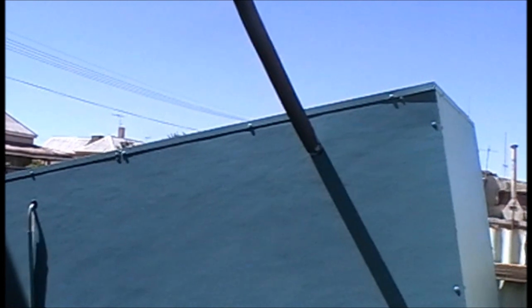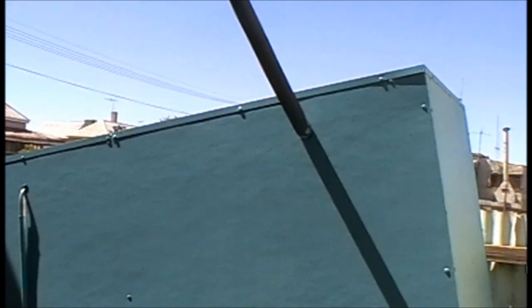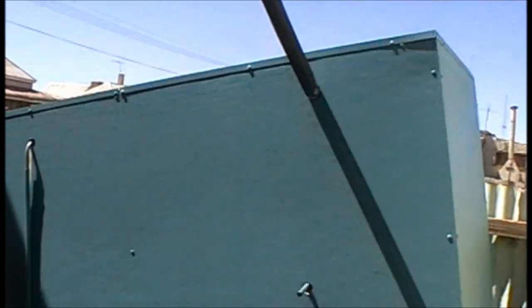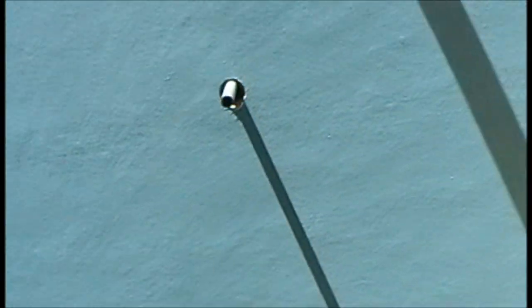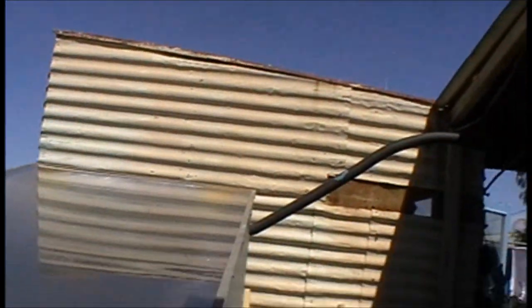The tank inside is a mains pressure steel cylinder, glass-lined. I painted it black with some stove — like pot belly stove — black paint. And I made a cradle out of treated pine, with the thing sitting up off the ground to keep it dry. I can also put an additional panel on it as an auxiliary thermo-siphon on the front here when winter time comes around, so we should be able to continue to get some decent work out of it. The shadow is just starting to come across it now — that's the chimney that shadows it.